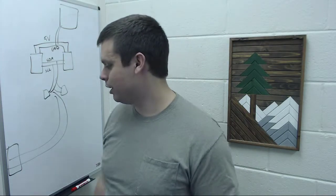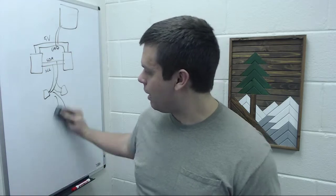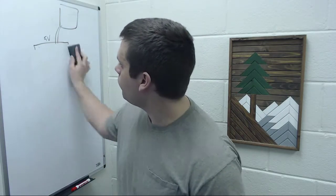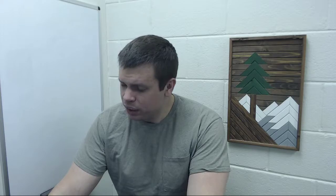But if I had more experience, I would have known ahead of time that I2C is not really a good solution for anything not on a printed circuit board. So that was quite the experience trying to figure that out. We stuck with that all the way through TR1. And then my early version of TR2 also had I2C, because it's like, what else am I going to use?